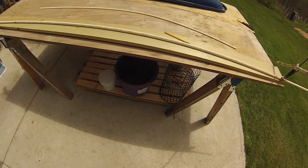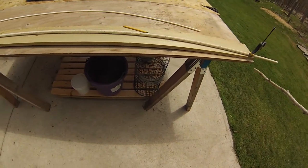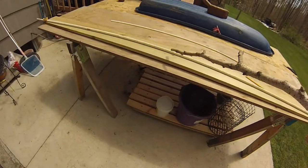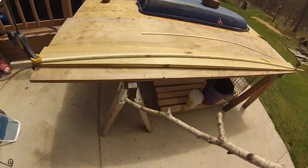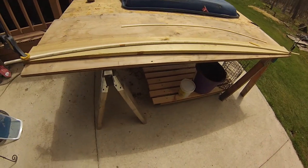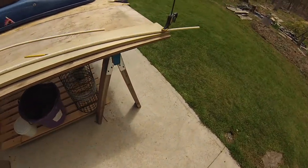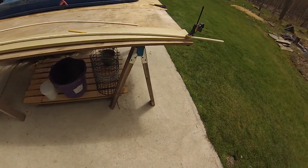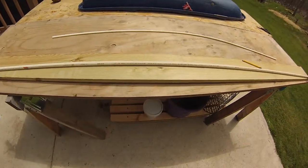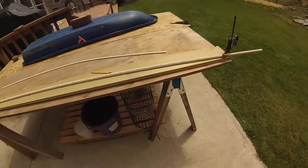Then unclamp that pipe, re-clamp your board down on each end, and maybe slide it out over the edge so you can get a skil saw on that. Then you're just taking a skil saw right down through that board and end up with a beautiful curve — literally, from start to finish, that's probably a three-minute job, so quite simple and quite easy. Just thought I'd pass that along. I had a couple of questions on the curves from that last build of the enclosed garden. This is your Outdoor Artist, signing off.